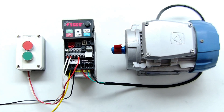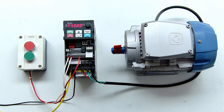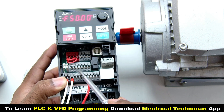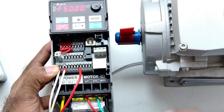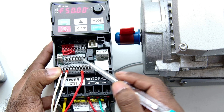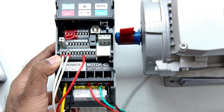For example, the VFD here will give a total output power supply of 10 volts to control its speed. We have to connect this 10 volt power supply to the potentiometer. In the VFD, you have to find where the terminal is given to connect the potentiometer. As you can see here, it is written as AVI and ACI. If you want to provide voltage to the VFD for controlling, use AVI. If you want to control speed using current feedback, select ACI — analog current input. If you want to select voltage, use analog voltage input. The wiring is very simple.